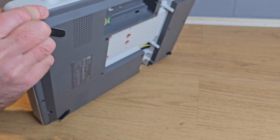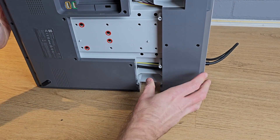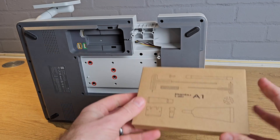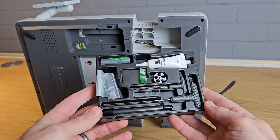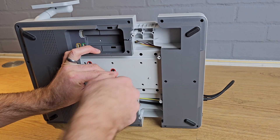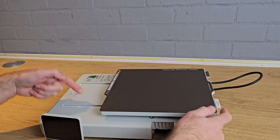With the print surface attached, lift the printer up onto the side that doesn't have the screen attached. This gives you access to four holes with red rings around them. This is where securing screws that need to be removed are located. To remove them you'll need to open up the supplied tool kit and take out the H4 Allen key. Turn the screws anti-clockwise to loosen them, then unscrew them completely and remove. Once they're removed, lay the base back down and your bed will now slide back and forth.